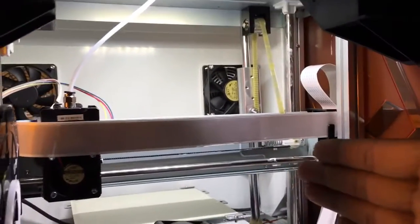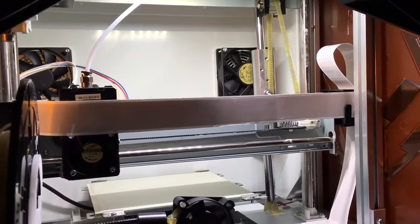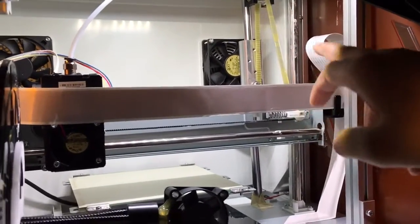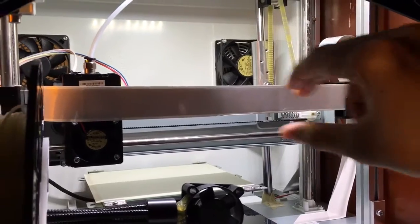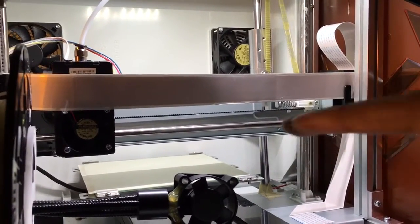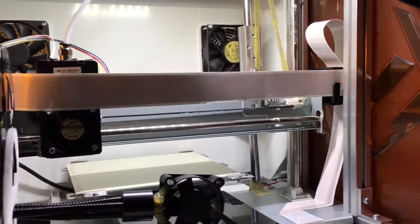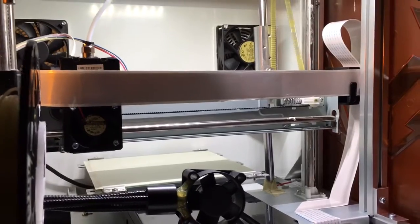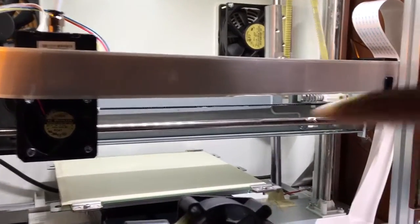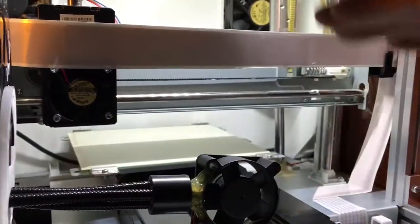The print on this side of the bed was always rougher. I'm kind of a stickler with things being perfect, so to many people it wouldn't have bothered them, but just noticing that difference was bugging me. What this also does is it smooths out this entire assembly. Those vibrations are now completely gone, and I have a very smooth print all the way from the low end of the bed all the way up — not very tall, this thing can only do six inches, but it's smooth throughout. When I'm doing the tests of sliding the paper, two pieces of paper here is the same as two pieces of paper here. I'm not having the issue of it rubbing slightly more on one side and being completely loose on the other. It's the same exact on both ends.